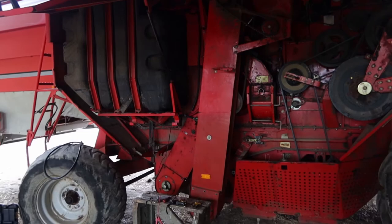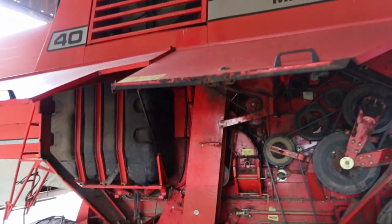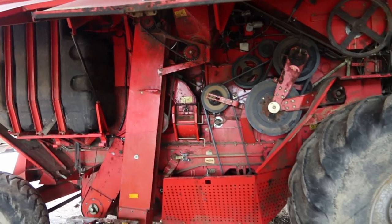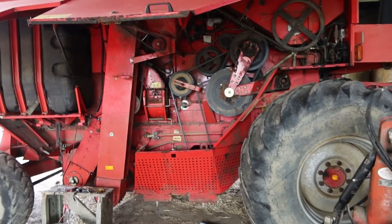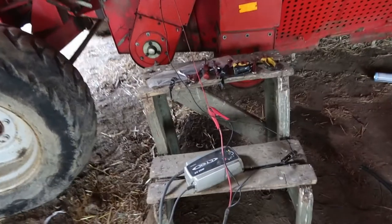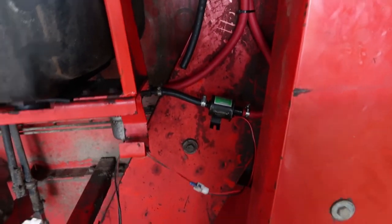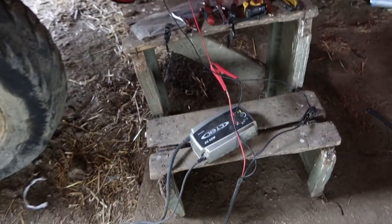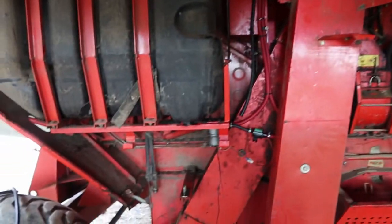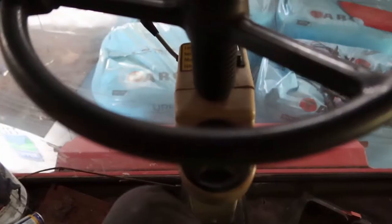She's running nicely now, running off its own diesel tank. It seems to have settled down, a small bit smoky, but that'll clear up after a while. It's probably just a lack of running and getting the last of the air out of it. It doesn't seem to want to start without the little clickety-clack pump, so I think we're going to be retaining that, but obviously need to connect it up properly. So I need to find an ignition control supply here, somewhere that we can feed that off.